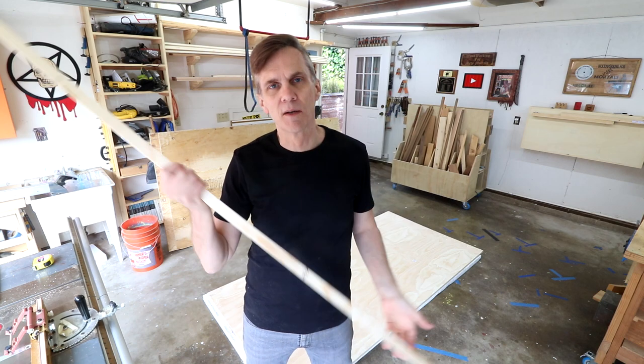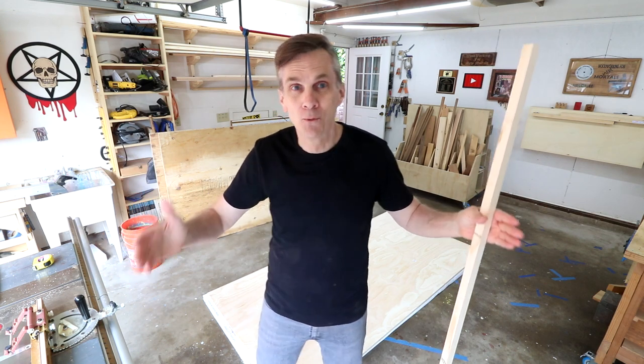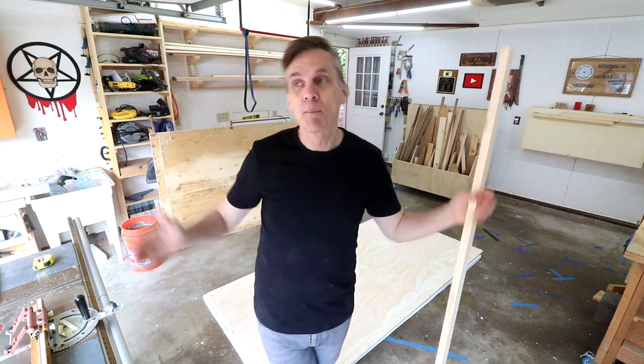It's a great idea to make a story stick whenever you need to build cabinets or really anything that needs to fit into an exact size. The last thing I would want is to make cabinets that are just too wide to get in there — that would be really difficult to fix. But if they're a little bit too small, that little gap on the ends can be filled in with the face frame.